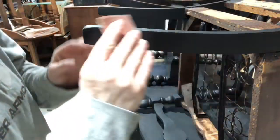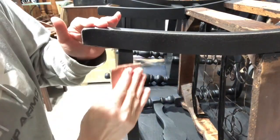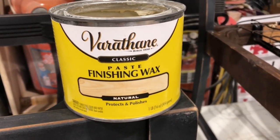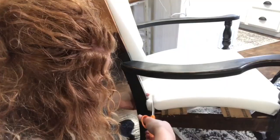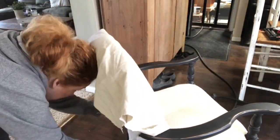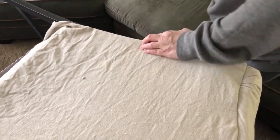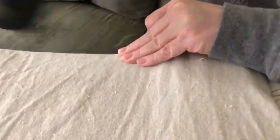I used the same Black Onyx from the previous flip — we are just creatures of habit. I like to start with the underside of the piece to get the most coverage, since chairs have lots of little crevices. I sealed the paint in using polycrylic as a top coat, then sanded the edges to get the distressed look — this was actually one of the first pieces we had ever done in black. After steel wooling, I finished the paint off with Varathane finishing wax to seal and protect. Then I added new webbing, new padding, and new batting. I like to reupholster using a linen drop cloth — the kind painters use — pre-washed with no softener. I just absolutely love the farmhouse look.